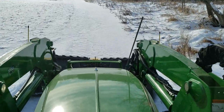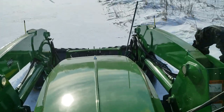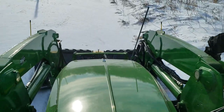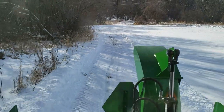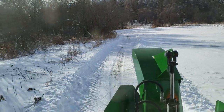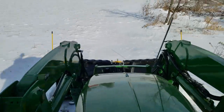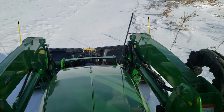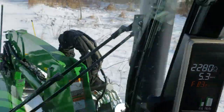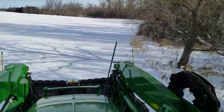Driving all the way out on this trail, I just kept it in B1 — that's the fifth gear in this gearbox, so it's considered one of the slower gears for this tractor. I know people plow faster, but I'm just getting used to the rig. What it's leaving behind is a nice smooth area. I'll do a review on the frontier snowblower when I use it more in the future — I do have that on the back — but snow like this you don't even need it. The plow does it all. She's driving along at about 2200 RPMs and doing really good, just pushing snow like a beast.